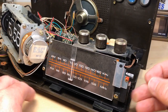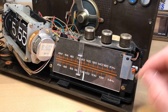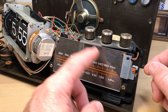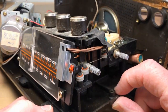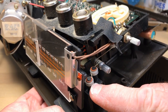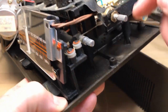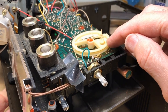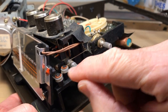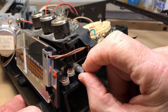We got this disassembled. The first issue we'll get out of the way is the tuner. The person who sent it in said the dial wasn't working moving back and forth — that's actually not that bad. This uses the old stringer type, where the string moves the dial and also moves the actual tuner on the circuit board. There's a post and the string is wrapped four or five times around it, but the post is just moving under the string.